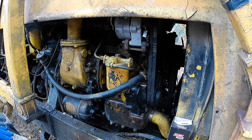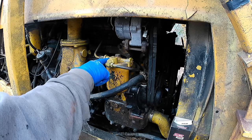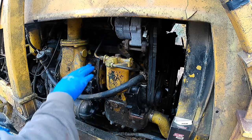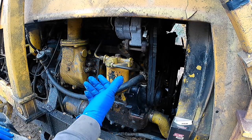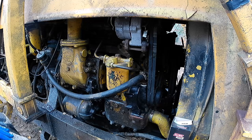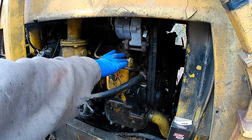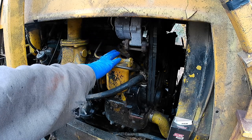So make sure you fill it, whether it's a spin-on type, because this is what came with it. Now some of these have been adapted over to a spin-on cartridge. I've seen lots of them like that, and that's fine. But still, fill it up. I mean, if you've got a 6-liter Ford, which is a piece of shit engine, it'll self-prime. It's a powerful engine and it's running, but keeping it running is another thing. So a lot of the newer diesels will self-prime. But if you're working on these old machines, forget it.